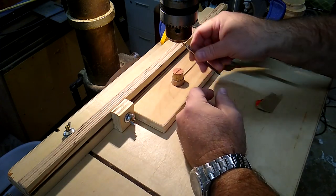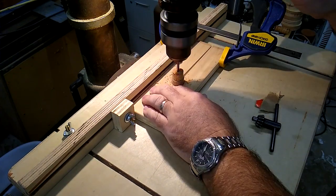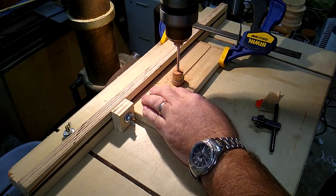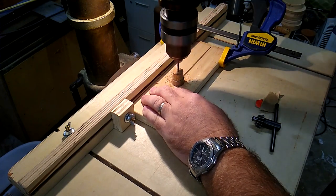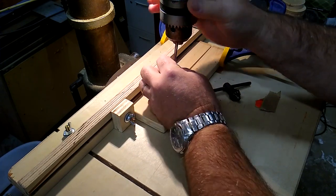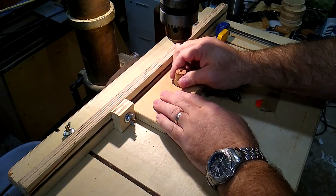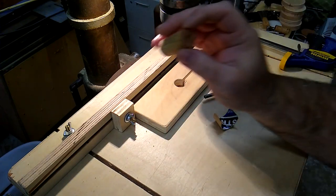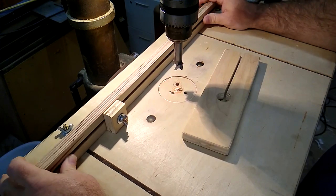I'm going to be using what's called a center drill — I'm using that because they tend to run pretty straight and true. Really any drill bit will work; just use whatever size you need to fit onto the arbor you're going to turn it on. I'm going to drill all the way through that cork, then unclamp it from the table, take it out, and make sure the hole through the cork is fairly well centered in the cork itself.